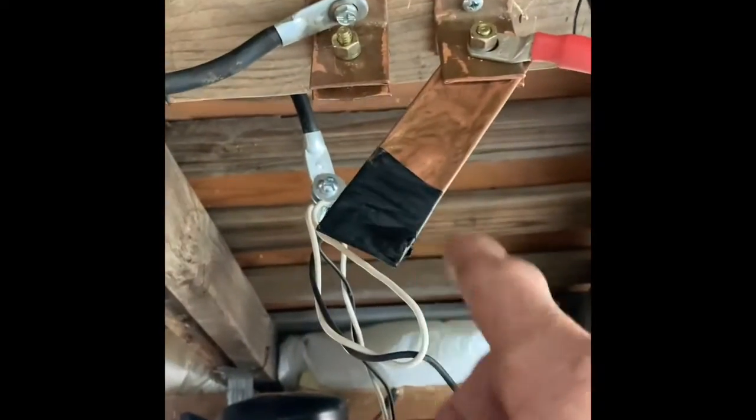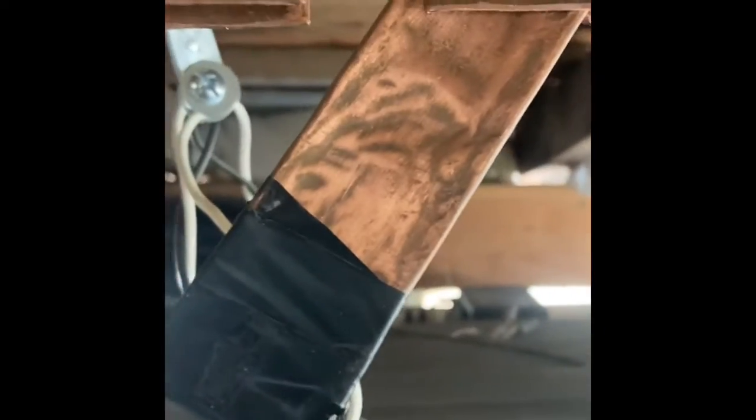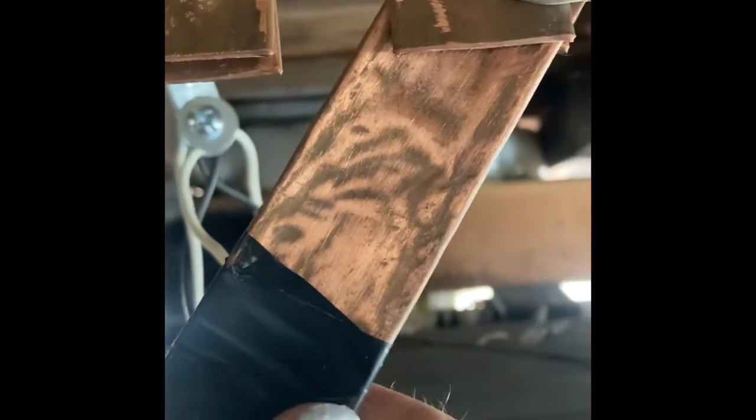I got this big 3 foot by 2 foot by 3 foot, 4 foot refrigerator. It's straight 12 volt. So I ran jumper cables, 25 foot, from the main battery bank. This is just a temporary setup. I had made this knife switch out myself, and I'm getting ready to turn it on. As long as the solar's up, I can run it, but it draws a lot of amps, so I need more batteries, but I'm testing it today.